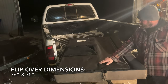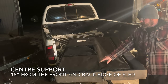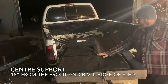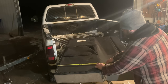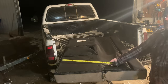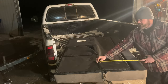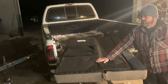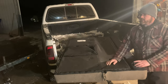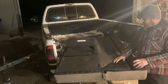I'm just going to double-check the measurements. There's a center support board that goes right down the middle of this couch, which will essentially be the anchor point for our pivot pipe. The front half of the couch measures dead center to that support beam at 21½ inches, which gives us 3½ inches of overhang — that's okay because there's room to the front of the sled. From the center to the back is roughly 20 inches, so that means there's 2 inches of overhang towards the back. That might be an issue, but we'll see how it goes. The cool thing about the way those slip-overs work is that all of the support beams telescope, so we should be able to kick those out backwards a little bit and accommodate the couch underneath them.